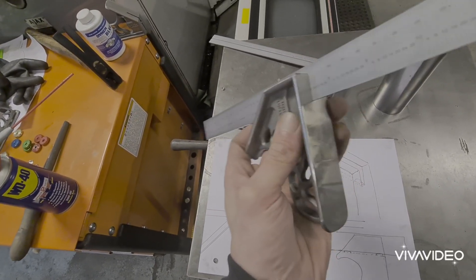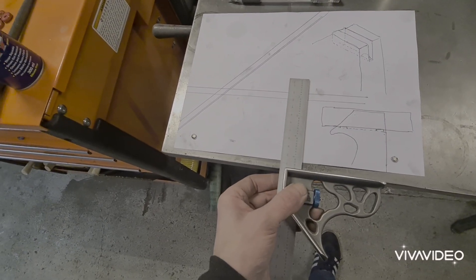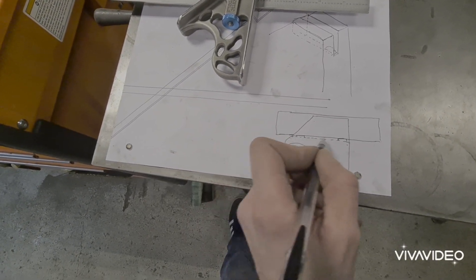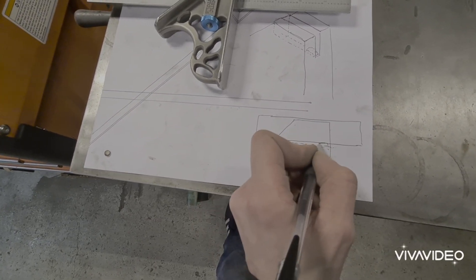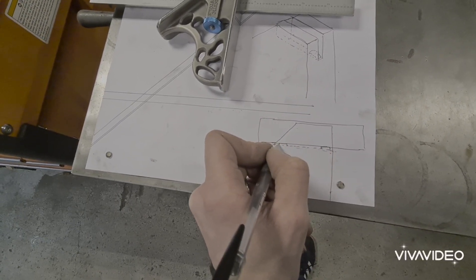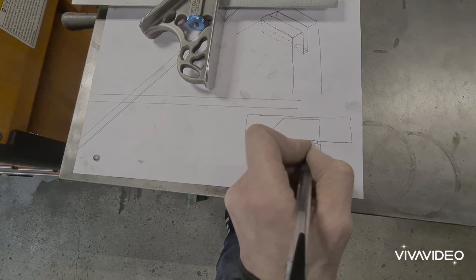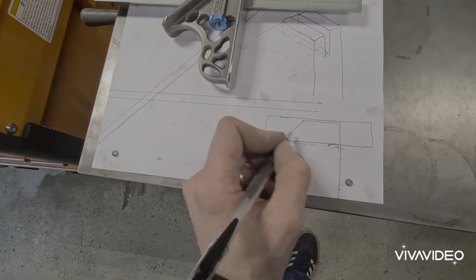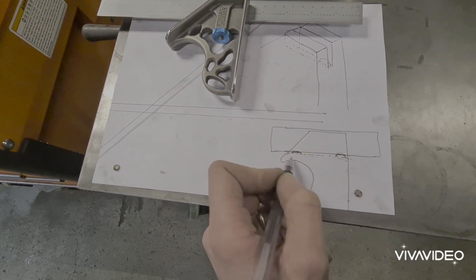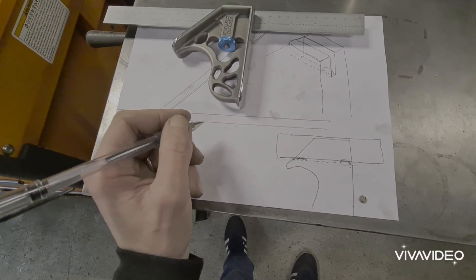They are 30mm wide, so if you're working on something with like a 5 or 6mm radius on a corner it's not going to slip over that radius — it's going to sit nice and flat still. The other design difference is where the slot is: on ours it's perfectly flat, whereas some squares have little tabs that can be filed to get your square set again, but I find those don't stay as true for as long because it's such a small surface area that can wear down faster on one side. On ours, because it's all flat, there's nothing much for it to wear down. You do have to make sure there's no grit or grime underneath, so it's always worth giving your rule a wipe off first.